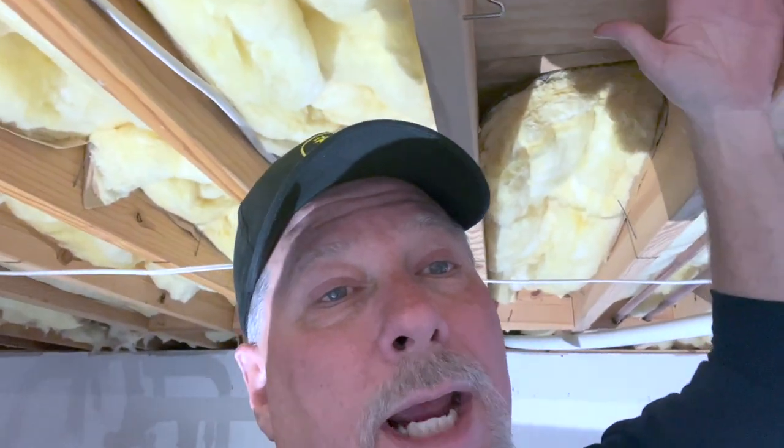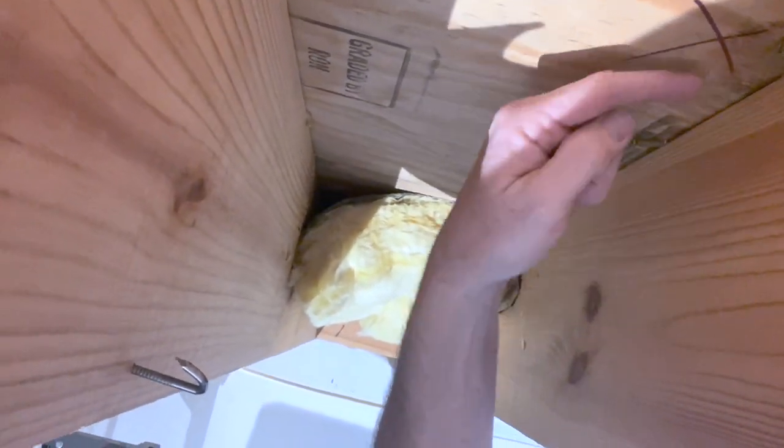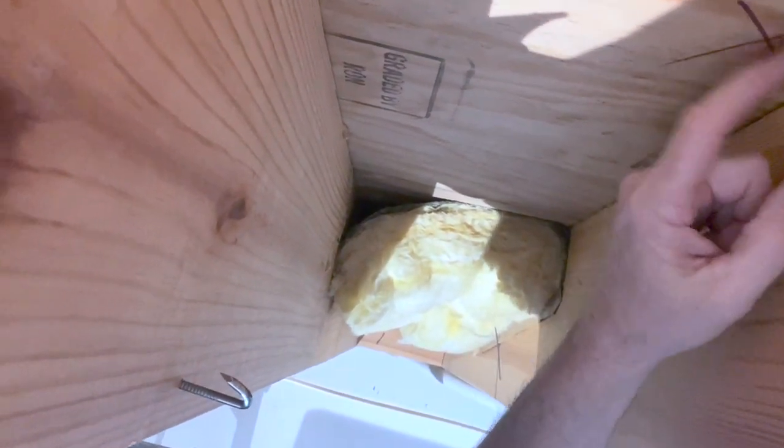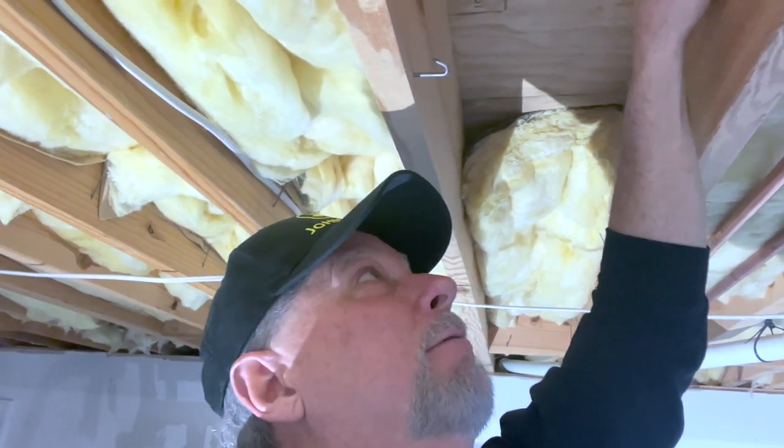You want to be careful — make sure you don't use too big of a screw. What I did is I got my wife to go up to the areas where I had the squeaking, and as she's stepping on it and it's making the sound, I come and find it underneath. I did not go into the wood — I went in between the joists where there are little gaps and I just barely ran a screw up in. This is three-quarters of an inch ply with Luan board on top and then my tile, so I'm not going to cause any problems because I'm not putting the screw in far enough to buckle it. All I'm doing is putting it in far enough to stop that movement. I just ran these screws in and the squeaks went away. I had about five or six areas doing it and this worked beautifully to stop every one.